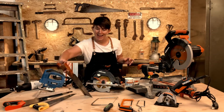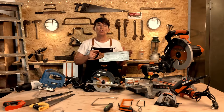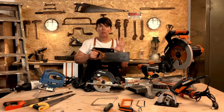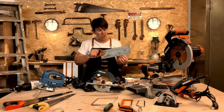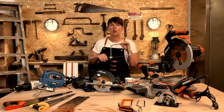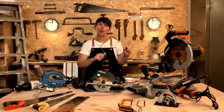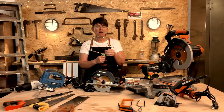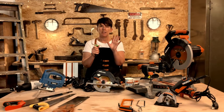This is known as a tenon saw, and basically this is for more detailed carpenter work. They would use this for cutting joints and for mouldings like dado rails, picture rails — a little bit more of a delicate thing. It's a much closer together toothed edge, so you can cut multiple materials with that. This funny looking fella here is called a coping saw — it goes along the lines of your jigsaw and is for very fine scrolling work. Jewellers and silversmiths will use this for cutting with a very fine edge to get really delicate, intricate cuts.